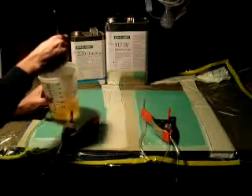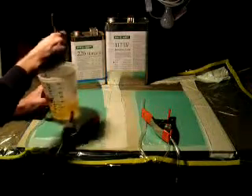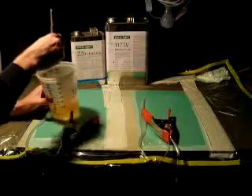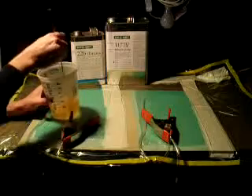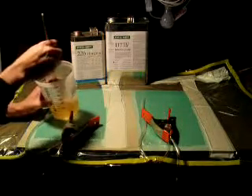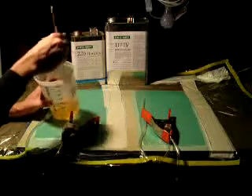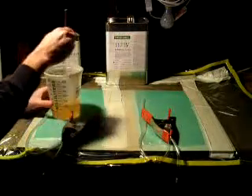So I'm going to stir this for a little longer, and then I'm going to stick the tube into the Resin. Once I do that, I'm going to release the clamp, and once the clamp goes, the Resin should start to flow. You can see that I have some breather material right here that leads all the way over to where the vacuum inlet is.